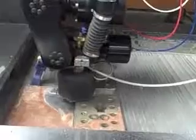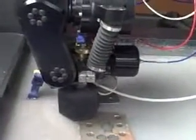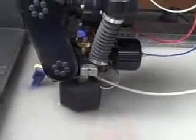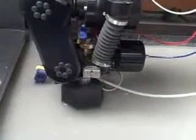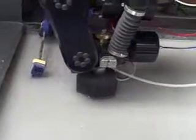But also I need to be sure that my thickness is properly set as well. So we'll set that to 1 inch instead. Let Make calculate for a moment for the tilt. And we're ready to go here. Raise the water level. And thankfully we don't have to raise it so high this time. And once I'm happy with the water level, we'll go ahead and tell Make to begin machining. So here's the third cut, starting now.